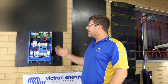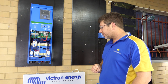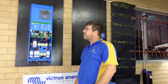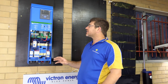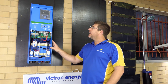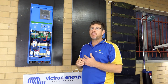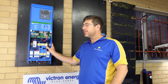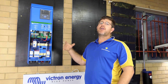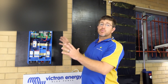That's basically the ins and outs of the Easy Solar — really simple, easy installation. They're easy until you need to grow them or do something different, then things can get a bit complicated. A 24-volt system can handle about 2.5 kW of solar panels, where the same system in a 48-volt can handle up to 5 kW. But if it fits within the parameters of what you're wanting to achieve, these are a really good solution.